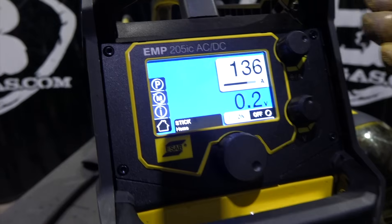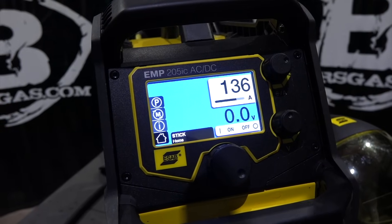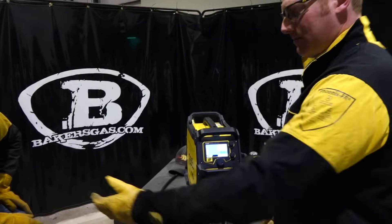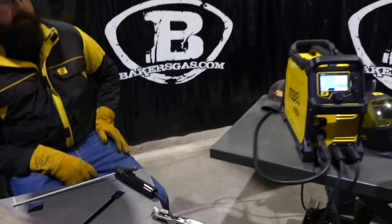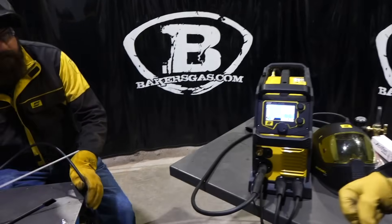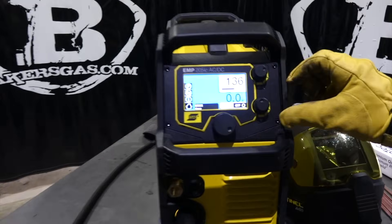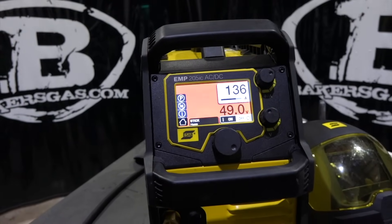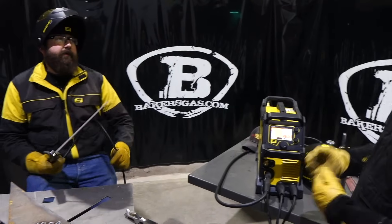One thing you're going to notice — this is a new feature on the Rebel that came out about three months ago. You see this little flashing indicator — this is the contactor for the machine, it's a safety feature. If I have my leads hooked up and the electrode is touching the metal while grounded, normally we would strike an arc. But with the contactor off, it will not strike an arc. The screen is blue when off. If I turn the voltage knob to on, my screen goes orange and my open circuit voltage comes up to about 49 volts — now I'm ready to weld. It's our way to prevent somebody from getting an arc flash. That's a safety feature.